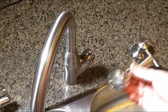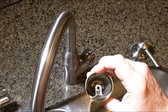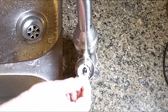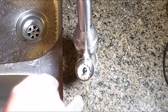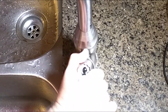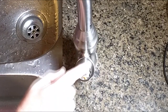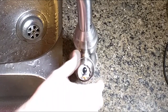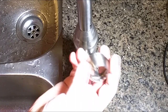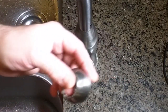There you have it — it comes right off. While you have this open you might want to put a little CLR on that and clean it off. So you can see here is the valve. There is an outer cap that holds it — it's mainly cosmetic. We're going to turn that counterclockwise. This is actually a plastic material coated with the same stainless steel finish.